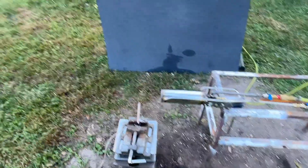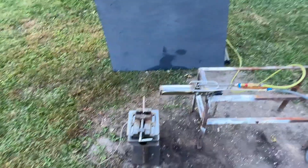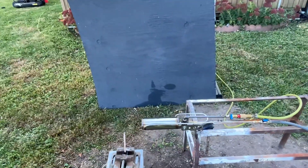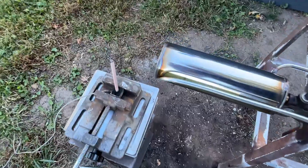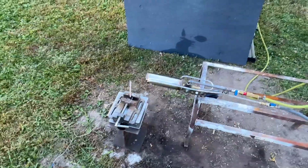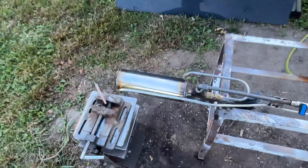We have an S-type thermocouple, but it's from China so it might not work. We've never hit 2,500 degrees on a thermocouple open flame test before, so to do that would be a big achievement. We're going to do an open air test to observe the performance. I'm hearing some buffeting in the air that I don't like — there's about a 20-hertz buffet in there.